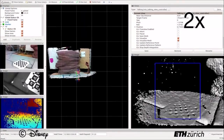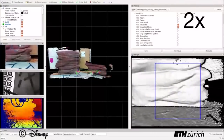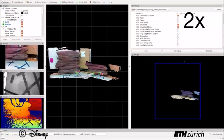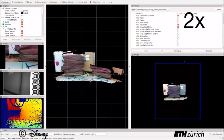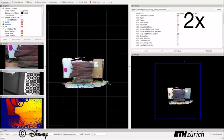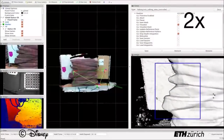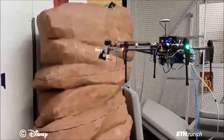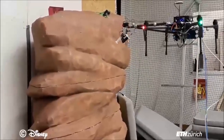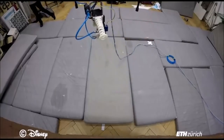Next is the live painting mission. At the start of the mission, the UAV performs a relocalization operation to register the live view to the pre-scanned 3D model. The UAV then autonomously flies the trajectory generated in the task planning stage, and the pan-tilt unit is directed to spray the surface using the target spray points. The UAV maintains its pose estimate by localizing against the pre-scanned 3D model of the target surface.